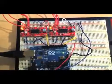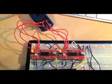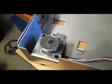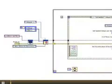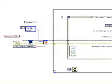Each of those controller boards is connected to the steppers by means of this cable assembly, and then into this chassis that we're also going to be using to control an Etch-a-Sketch. Here, if we look at the block diagram of just an example VI, we can see how straightforward it is to use both the Arduino toolkit and the stepper motor VIs that act as an extension to that.